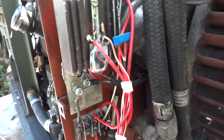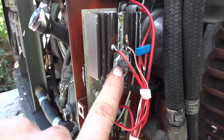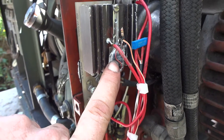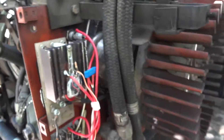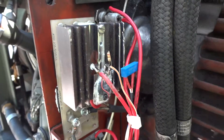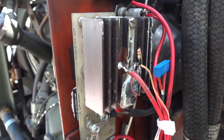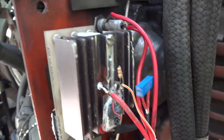What we have here is a linear voltage regulator capable of one and a half amps. Its output drives the base of a power transistor — if you can see it over here, it's in a TO3 package. The power transistor is capable of 16 amps, which is kind of marginal, but it is heat-sinked moderately. With all this wind blowing here, that heat sink ought to be pretty good.